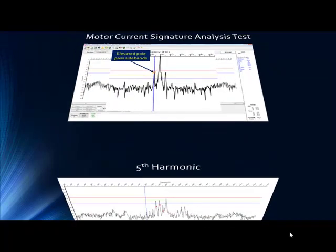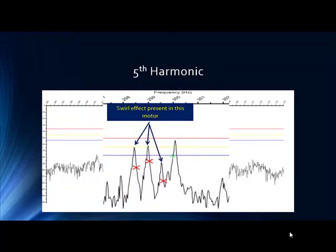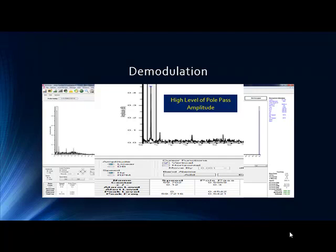We always tell people to go out to that fifth harmonic — it's very important. Our tech support likes to see three indications of rotor defect before they make a call, just to make sure you're not sending this large motor in for false repair. That fifth harmonic is an area where we like to focus, which is a confirming piece of information that a break in the bar itself is really affecting the air gap flux. So let's do the checks: we have vibration telling us at the 3x order of harmonic there's an issue; we have motor current signature analysis with pole-pass sidebands around fundamental frequency showing there's an issue; and now we have the fifth harmonic — that's three. So we come up to our fourth one: demodulation. On large two-pole motors, demodulation is our number one indication for rotor defects. In demod, we're looking at the same current signal but stripping out the line frequency information, which allows us to really focus in on that demod peak. The alarm threshold is at 0.3, and this one is at 0.45 — another strong indication of rotor anomalies.